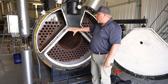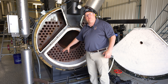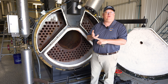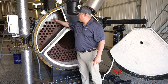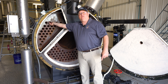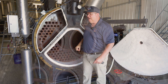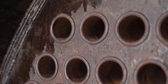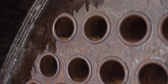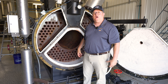When we've got a boiler open for inspection, we're looking for cracking on welded tube sheets. Look for chemical indication and mineral indication. On a beaded tube sheet, we're looking for movement. When that was beaded, it's pressed against the tube sheet and it should be against the tube sheet. If you see a significant gap between that beaded over edge and the tube sheet, you've had thermal expansion and contraction that's pushed that end away.